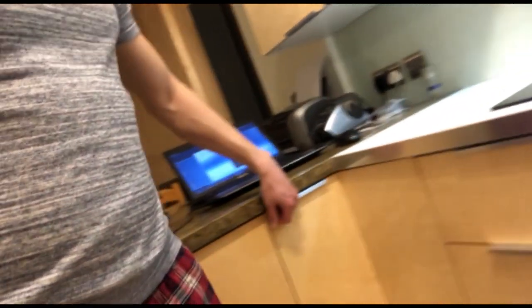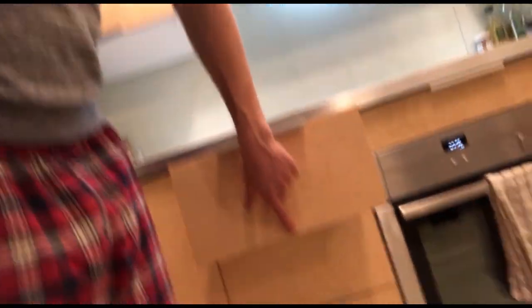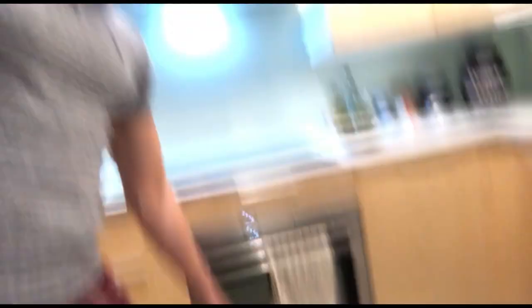We've got an 800 by 600 door for the fridge, mounted straight under it. For a 600mm wide unit the door width will be 597mm. There's also a slightly awkward corner door which took extra effort because the hinge positions are slightly different - I've got a download available for that one. The drawers are 200mm high, so those will be 197mm in height and 397mm in width.